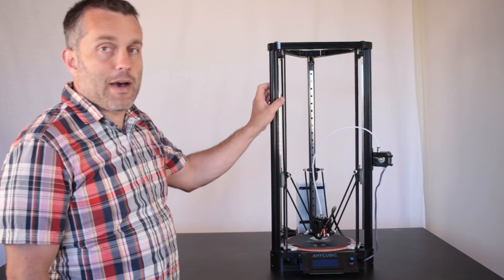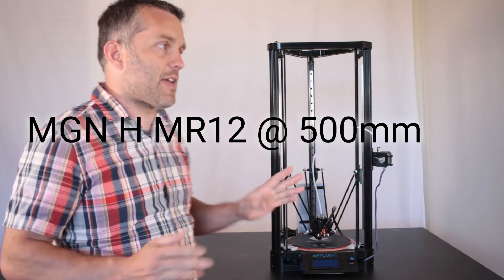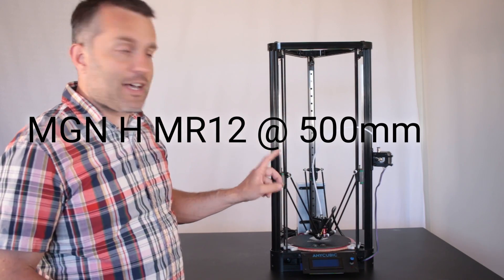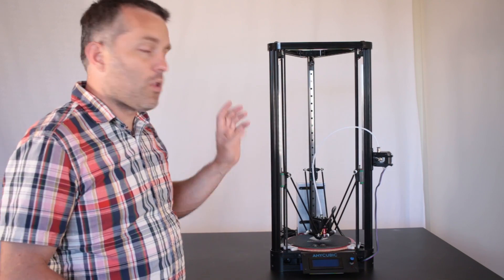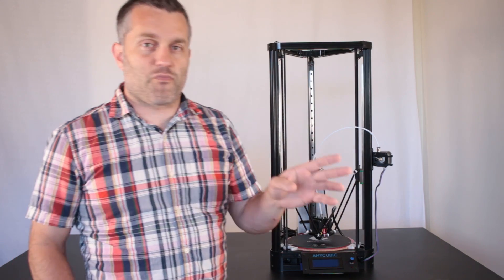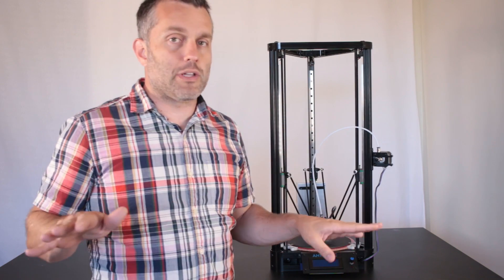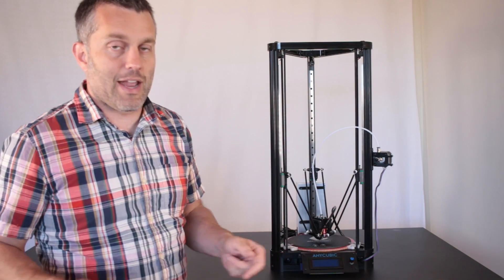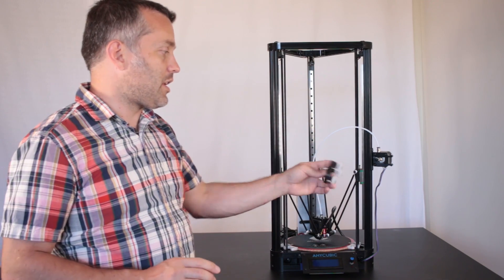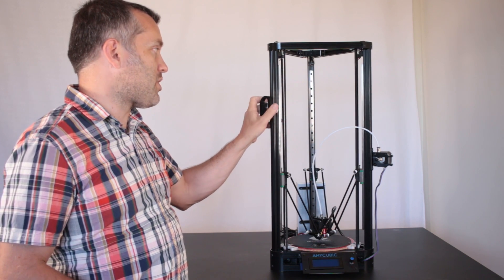Now let's talk about the linear rails. On the screen I am going to put the technical name — MGN block, something like that — of these linear rails and bearing blocks. You will also find that information in the description below, so that is just for your convenience so you know what part you need to go buy if you want to do this upgrade. But you absolutely do not need to do this upgrade and it is kind of a waste of money — there is no difference in quality between the linear rails and the pulley carriages that came with the printer originally.